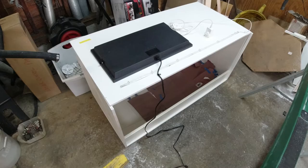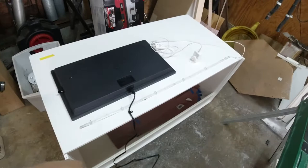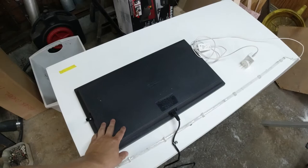From this point I didn't have much footage. Basically, I went to Lowe's and purchased two sheets of glass and had them cut there. The height was 16 inches, but there was an issue — the glass was too tall and didn't fit. I had to remake the top bar to fit it properly. Here's the top piece, flipped upside down — it'll have the radiant heat panel facing down, secured with three screws.